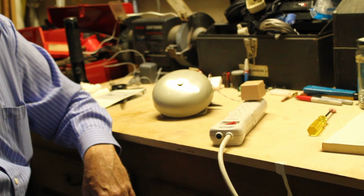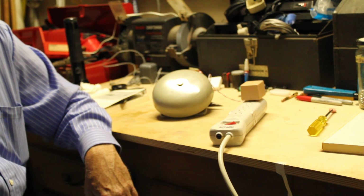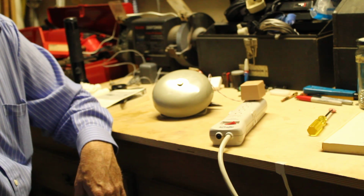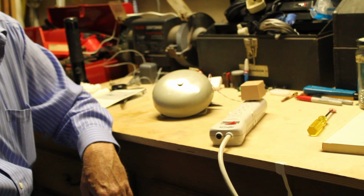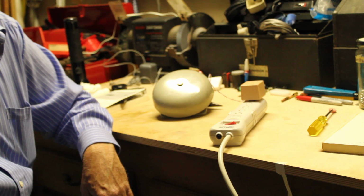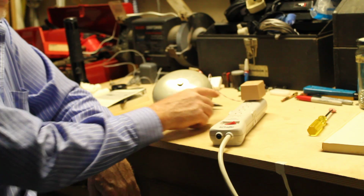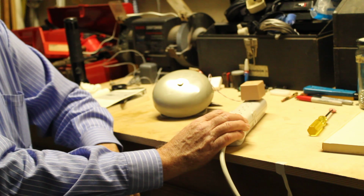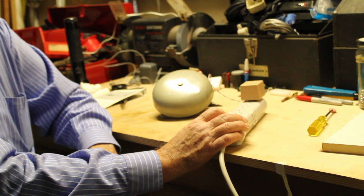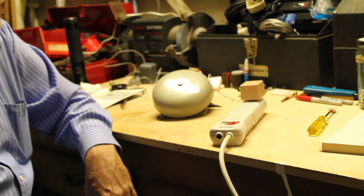So if you were to hook it up to a Viking Electronics contact closure device that would close a contact on an input of a ringing generator at 90 volts AC, 20 hertz, typical POTS line ringing generator, it would trigger a contact closure. You could wire that in series on one of your leads and it would ring the bell if there's a phone call coming in, on, off, on, off. So that's what we have here.